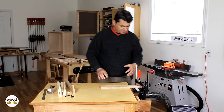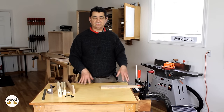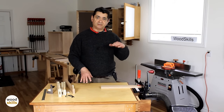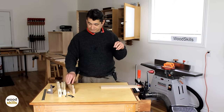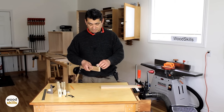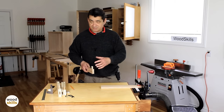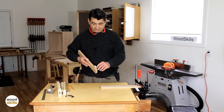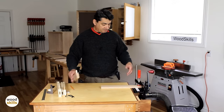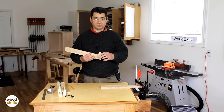And I'll actually talk about the additional part of this, the micro-adjust part of it that I created afterwards to facilitate moving the assembly up and down. So the crosshairs are centered where the actual location of the loose tenon or the mortise will be located. For example, this is centered along the edge, but it doesn't necessarily have to be centered. It could be offset from either side. Hence, they provide this adjustment, and the adjustment also enables you to create slots in thicker boards.